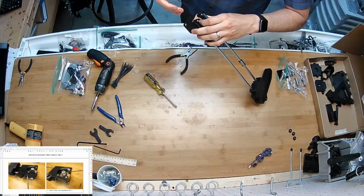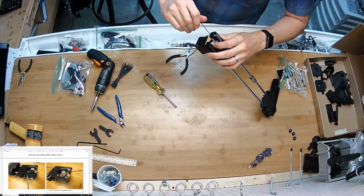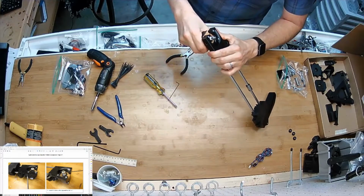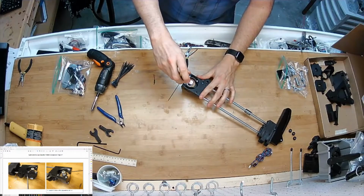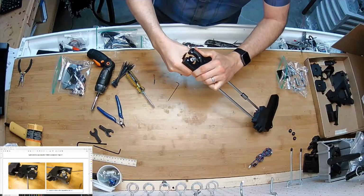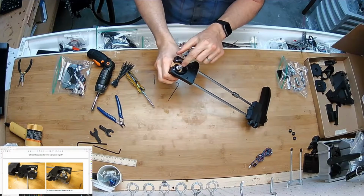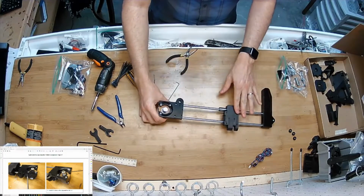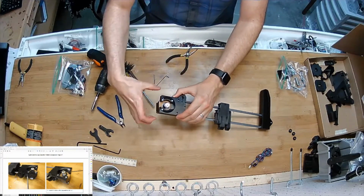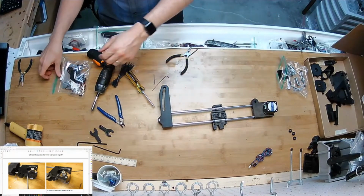There it is. And tighten it on there really good. Yeah. Okay. Now I'm going to make sure this motor is not too snug, that you can actually rotate it. I'm going to rotate it towards the system to give the belt as much slack as it's going to need. And then I'm going to install the belt, and then I'm going to be pulling on this to get the tension that I want.